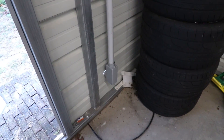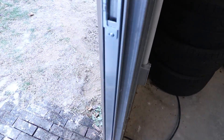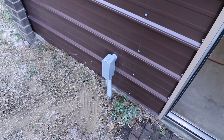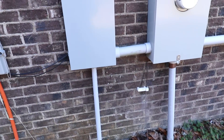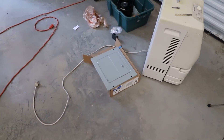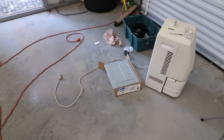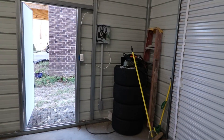All of the conduit is going all the way down into a 90. There's a little air around there — that's about the best I could do going through, and I will have to seal that up. On the outside, same thing: got a 90 going straight down into the ground. Everything under here was underground burial wire that comes all the way up and then goes into this panel, which is a 200 amp and now has a 100 amp breaker in it. If you need any information, in the description below I will leave all of the parts that I used to do this installation, and you will be able to order them directly from Amazon.